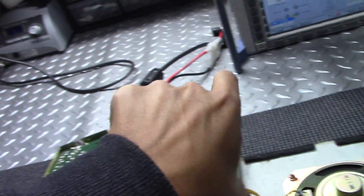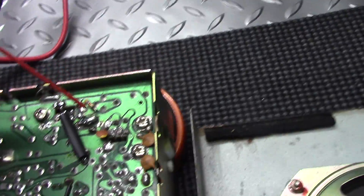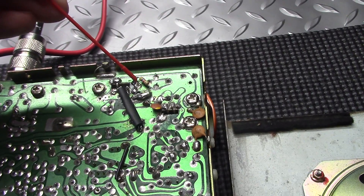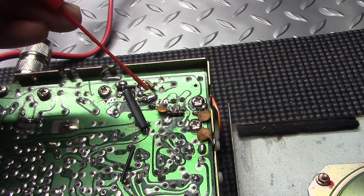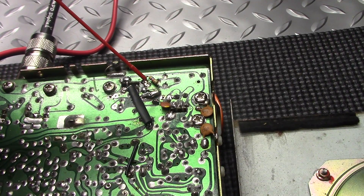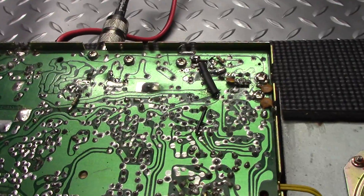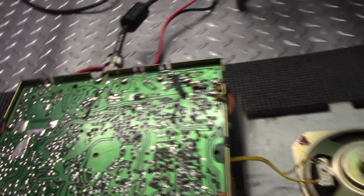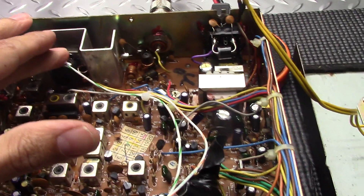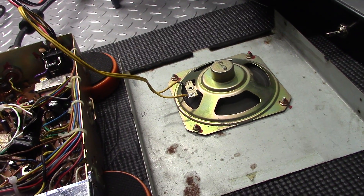What I do to make it simpler, because there's not a lot of room back there, is I tack it on to the solder side right here where R56 was. The resistor I used here was a 4.7 ohm — that's something you could play around with, you could go down into the 3 ohm range depending on what instructions you read. That's just the way I do it. So your final is replaced and your bias circuit is in place — that's two parts.